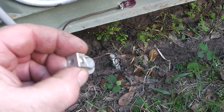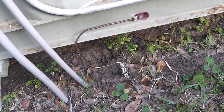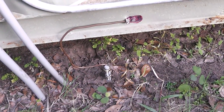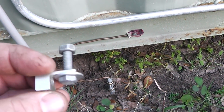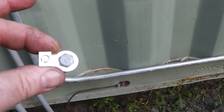This is just a lug — that's probably a piece of number 6 solid wire. You could use number 10 or number 8 solid, which would work great. Depending on what size service you have, if you have a 200-amp service on your shipping container you're going to need a size 4 wire, so I would do it to code. It's bolted on with a galvanized bolt. You can't use a self-tapping screw — that's going to lose conductivity.